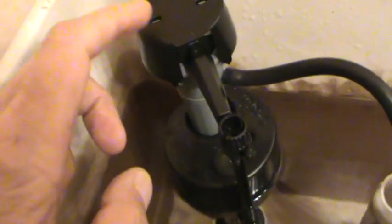Let's look inside the commode first. There's the fill valve — it's real easy to install. This goes into the overflow pipe and that goes down and fills the commode to a certain level. Down there you can see the two bolts — there are washers under those and you just screw them down. I put silicone caulk on them before I put them in. That's what attaches the back of the tank to the bowl.